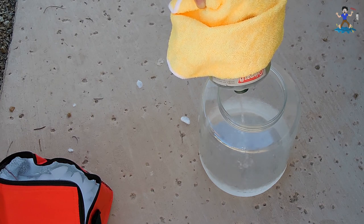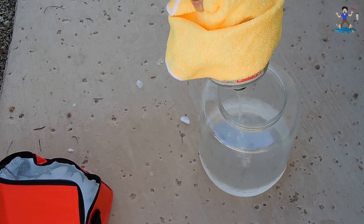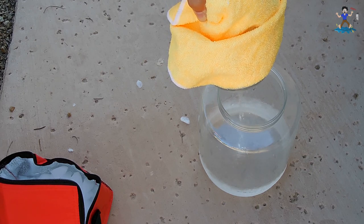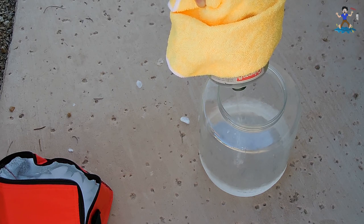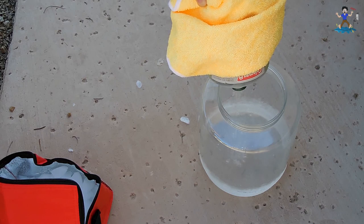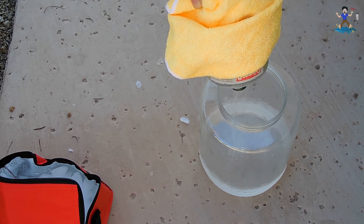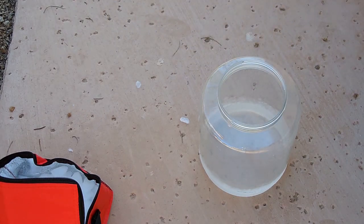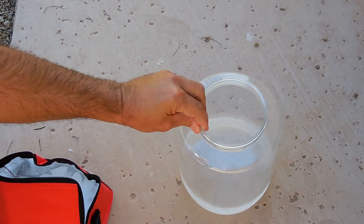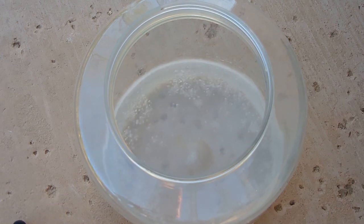The cylinder is still extremely cold, pressure is gradually increasing, and it's getting much lighter. Do not do this anywhere where you have static electricity or sparks. And there you go — it's empty. Right here you are looking at liquid propane, so let's zoom in. This liquid propane will continue to become a gas until all the liquid has disappeared.